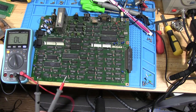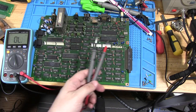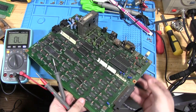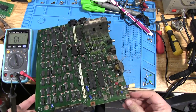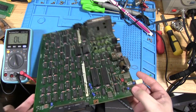The way you deal with this is you check all the components to see which ones have a path to ground that they shouldn't have. Starting with things that are to do with the voltage rail — things like tantalum capacitors are absolutely prime candidates — that's basically where we start first.